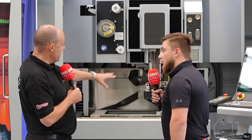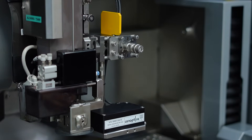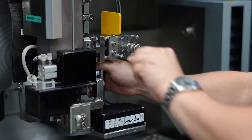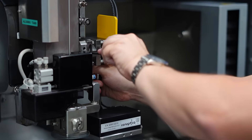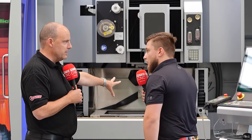If you identify that it's out of tolerance, the machine is quite intuitive — it will go back and actually re-skim the profile and then measure again to check that we're within tolerance. And it doesn't get in the way of your cutting either, because the camera system itself sits above and below and moves out of the way. When you're not using it, once you've inspected your component, you put it up out of the way and then carry on machining.